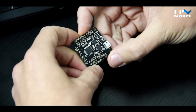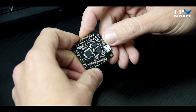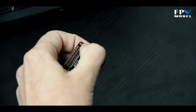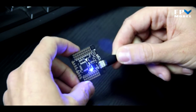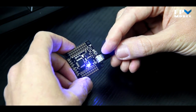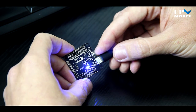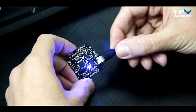First thing: there's a push button on the board for the bootloader, so you don't have to find a jumper or jump any pins. Just press down on the bootloader button, then plug in the USB cable. You'll see a solid blue light. If you see a flashing red light instead, disconnect the USB cable and press the bootloader button again, because the connection was not good enough.